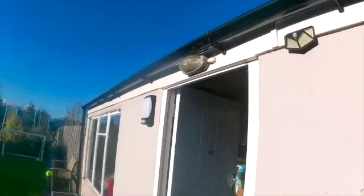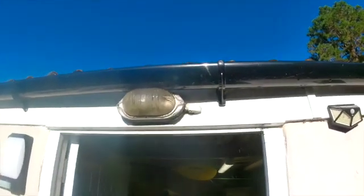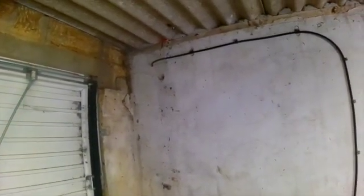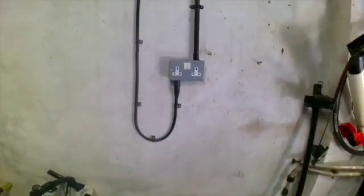That's where the old cable came through when I stripped the garage out and stripped all the cabling out. I've put a light on the outside there - that's still the old one. I haven't taken it off yet because it's just going to leave a really big dirty hole. The SWA cable comes in through the wall. Before, the cable was coming through the floor and was dug underneath the path, but I don't want to dig up the path this time - too much effort. Someone suggested going overhead, and I've fixed it quite firmly with a tension cable.